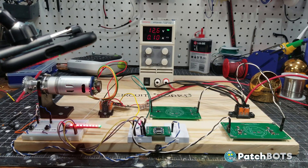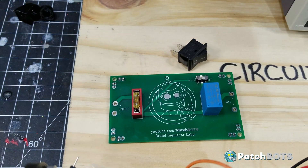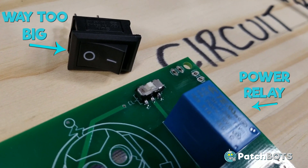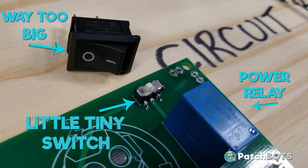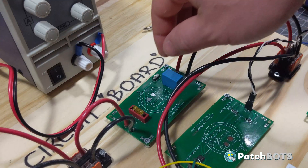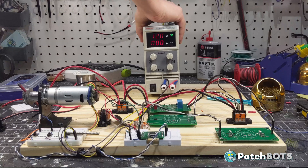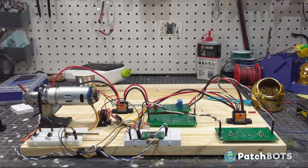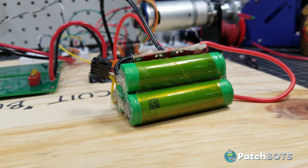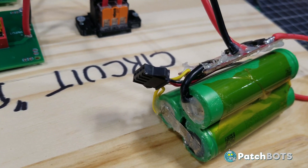Before we switch over to battery power we need to add a power switch. There isn't room on the outside of the saber for a switch that can handle the full current of the motor, so we are going to use a power relay to move power to the rest of the saber, and this little tiny switch here will control that relay. I also added a fuse just in case, and now we can power on our whole saber with an easily mountable switch. Now we can officially unplug the saber from the wall and go battery powered. The battery for the saber is going to be custom made — not unlike this custom-made 3-cell lithium battery — and it will have a balance charger built right in so we don't have to take the batteries in and out to charge.